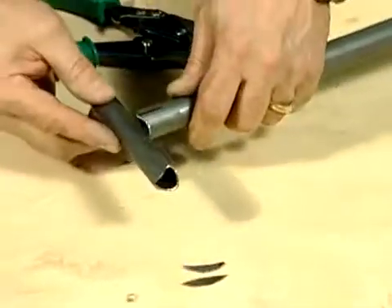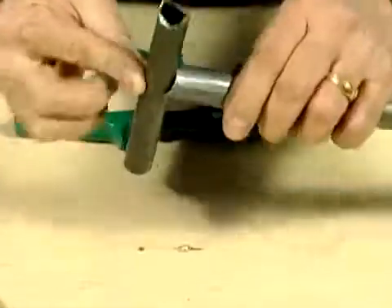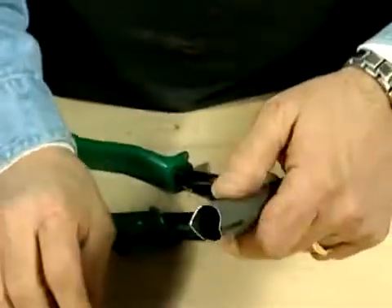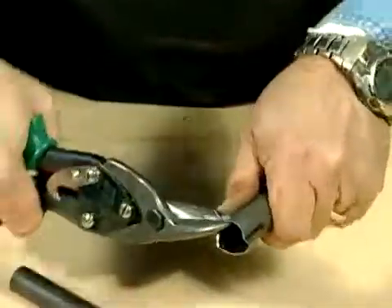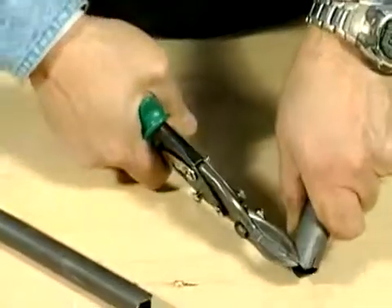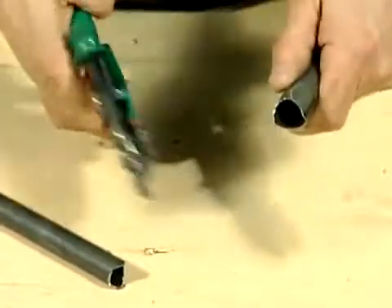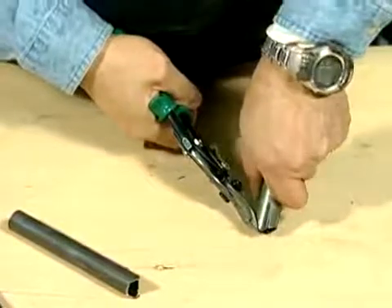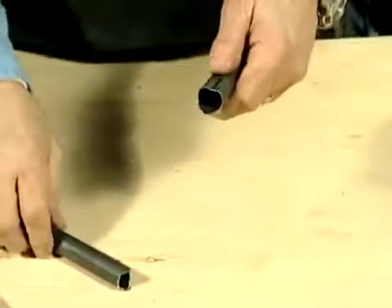When I put this together, you're going to see that I'm off just a little bit — not a perfect 90, but really close. So I'm going to take this end that's a little high. You can use tin snips again, or a grinder or file, because that doesn't take much. Be very careful that you don't twist your wrist like this, because that will spring the jaws and then you can throw these in the basket. I'm using the green handled snips because I'm right-handed; you may want to use the red ones if you're left-handed.